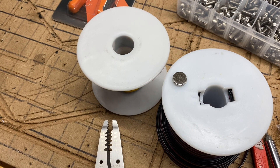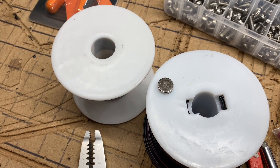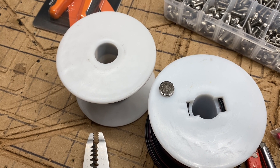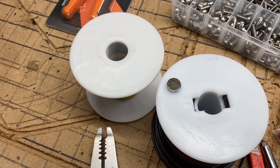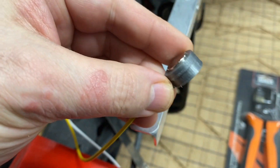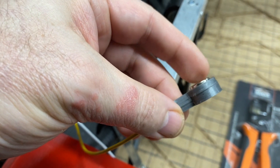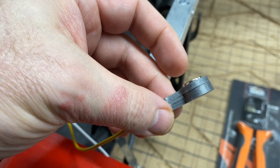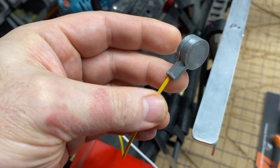I soldered the wire to one of the discs. As you may know, subjecting a magnet to heat can cause it to lose some or all of its magnetism. In this case I got it soldered firmly without losing much magnetism, but I had the concept of using a second disc that hadn't been subjected to heat to help strengthen the magnetic grip. The unaffected disc is a press-fit into the bottom piece, and the magnet with the wire soldered on gets pressed into the top part. Then a little super glue around the rim and hold the two halves together until it hardens — and it makes this great piece.